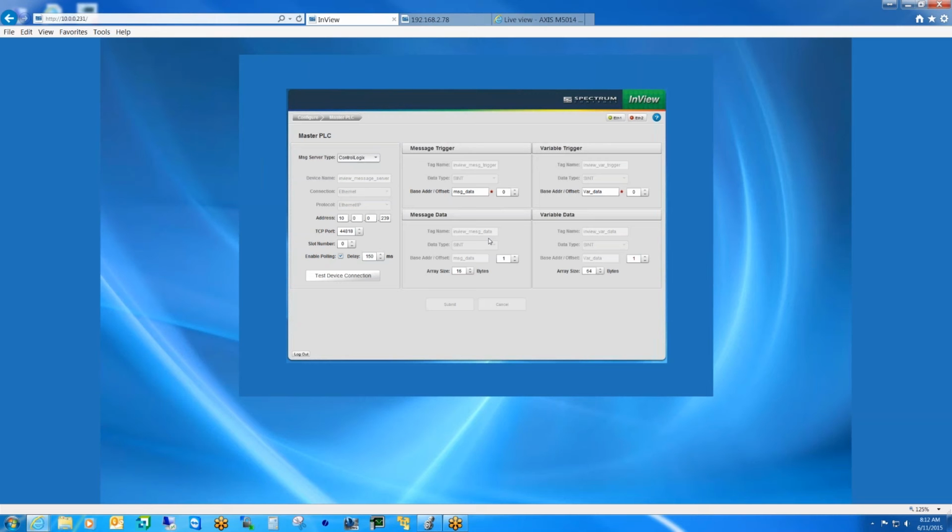Basically, on the controller side, we use add-on instructions to create an ASCII string in the native language that the sign understands. Now, in the very near future, within the next 3 or 4 weeks, we will be adding an additional feature to the comms module, which we call easy tags.